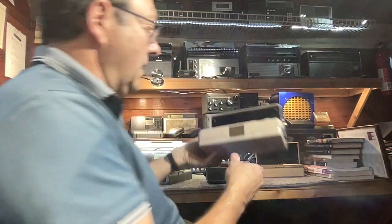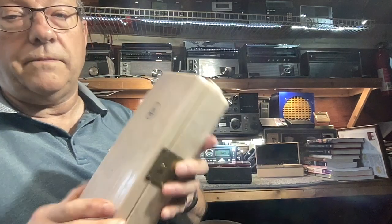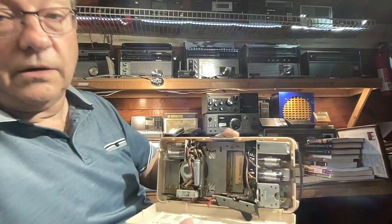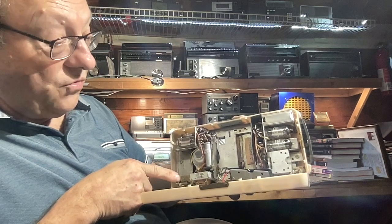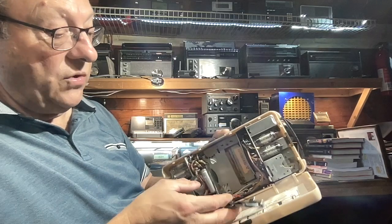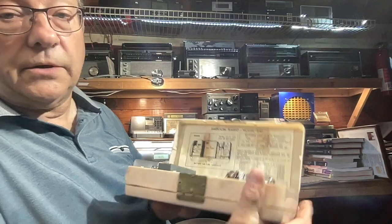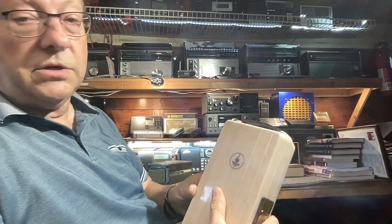And then there's the Emerson, which has a beautiful ivory marbled finish plastic — again a pocket and portable radio. The base comes off like the rest of them and you can see the four tubes with a 1.5-volt A battery for the filaments and a B battery at 67 volts. I've modified this one to use both the wide clip and the narrow clip for my battery pack. The Emerson is very similar to the Zenith my daughter bought me, and this one is in remarkable condition.